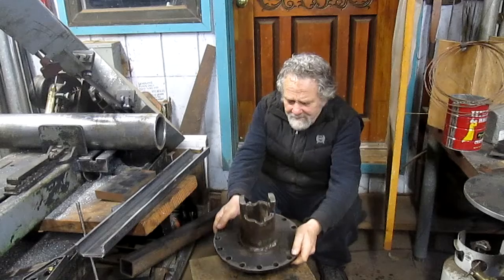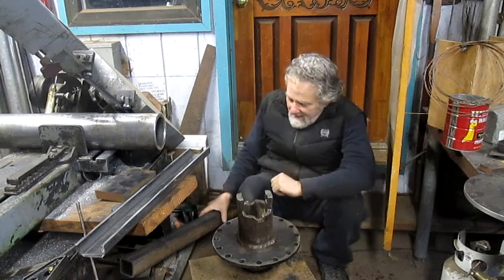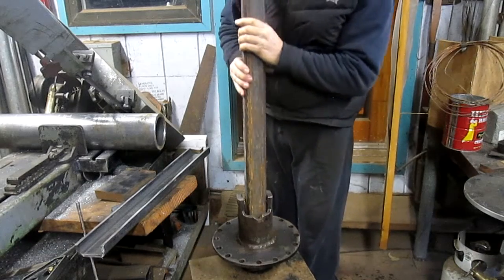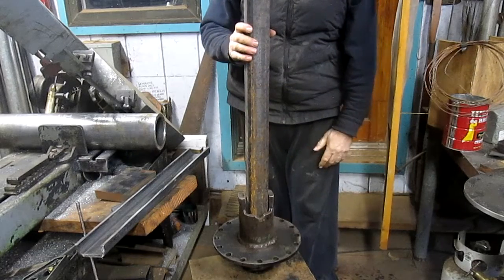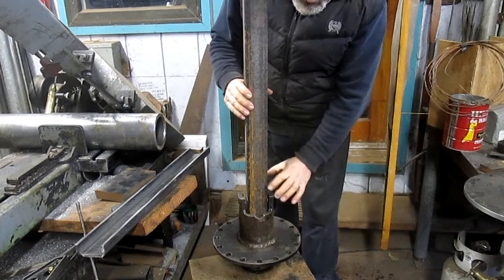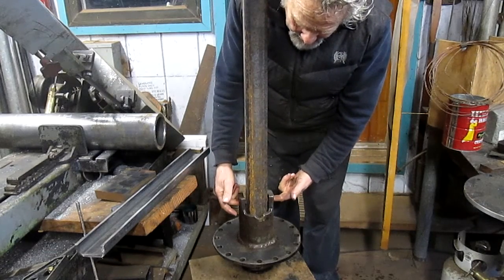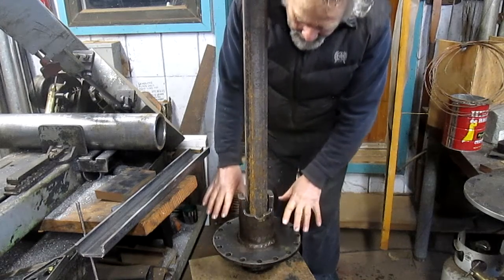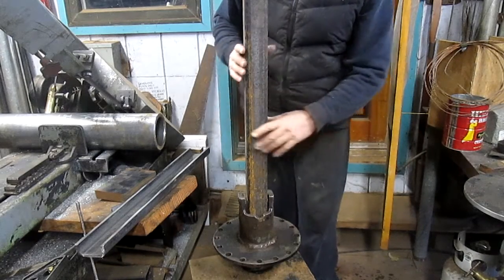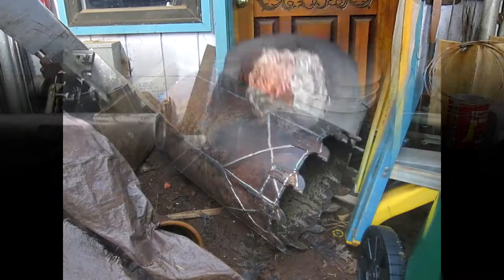What we've got is this hub. And what happens is a shaft very much like this one, except I think it's about 8 feet long and it weighs about 100 pounds, goes into the receiver here. And the receiver is set up in a square manner, and then a pin goes through the receiver and through the shaft, and so this rotates around, this connects to the drill head, goes into the ground and drills what they need to drill in the earth.